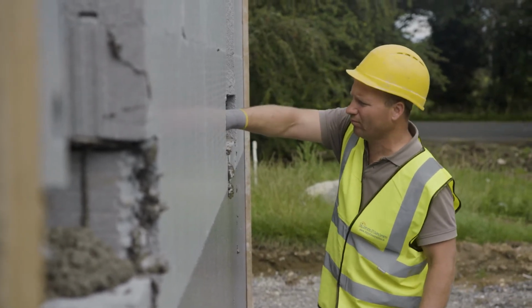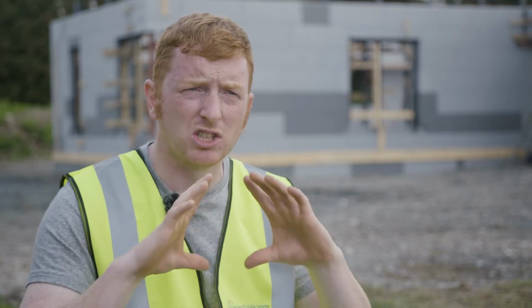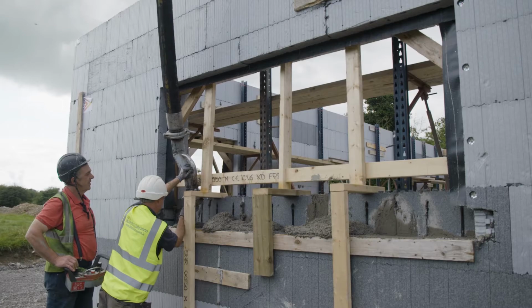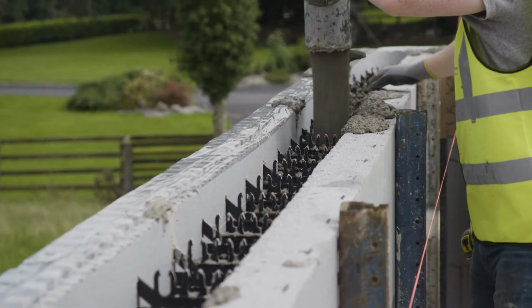And it's from our own work as well, you know what I mean? After we build up 2 blocks high, we pour the concrete into it. We go away then, all right? We leave out a 6-inch sleeve, and that's holes that are left out in the footings, the rising walls. Leave them out for the ground worker to run a 4-inch pipe through it for services.